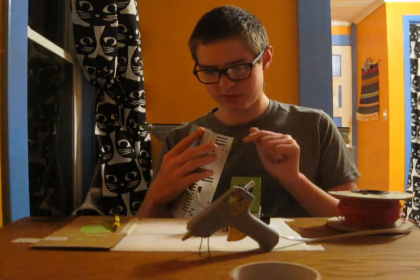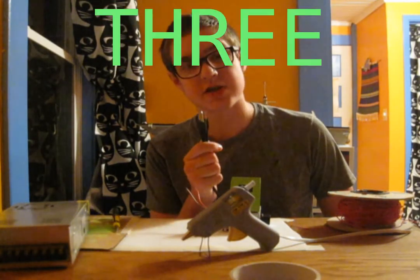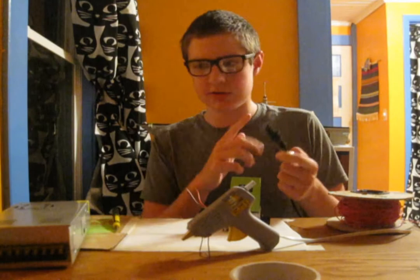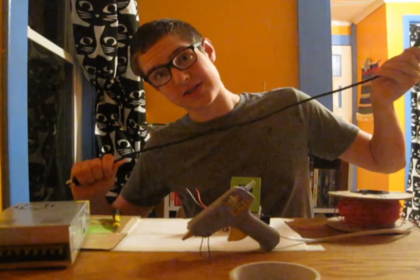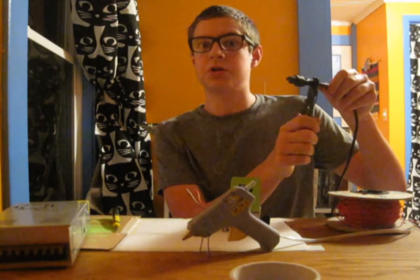This behemoth has terminals for the live wire, the neutral wire, and ground, which is why I have this three-pronged plug. So this three-pronged plug goes to one of those computer plugs you use for maybe your laptop charger or your PC. The plug is kind of fraying off now, though, so I'm going to cut the plug off and attach wires to it that will go to the terminals on the power supply. Also, this plug isn't long enough. Goodbye, plug.